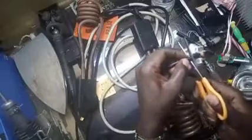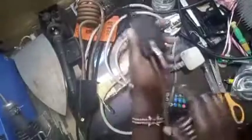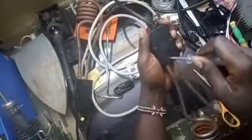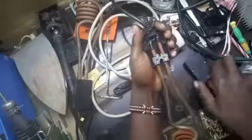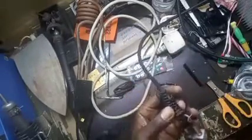So as my viewer, please, when you have a water heater, don't make the mistake of adding to the length of the wire. The original wire from the manufacturer is designed so that the resistance of the wire is equal to the resistance of the water heater. But if you add length to the wire, you are increasing the resistance, and when you increase the resistance, the wire will melt when you are not around and can be dangerous to your health and your environment.